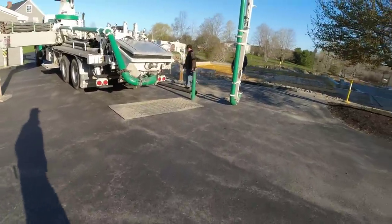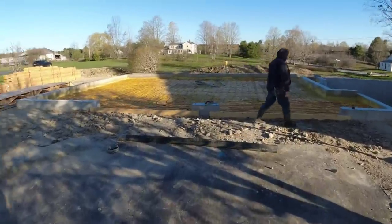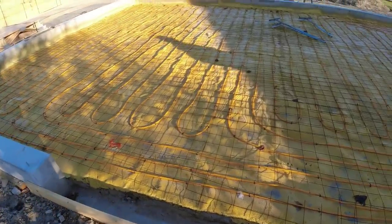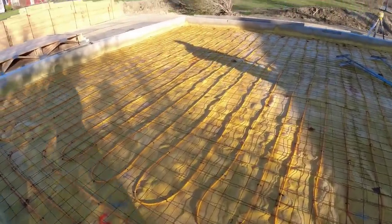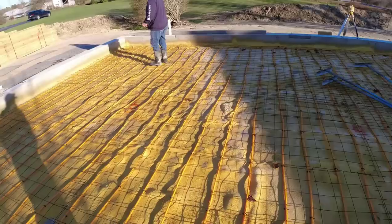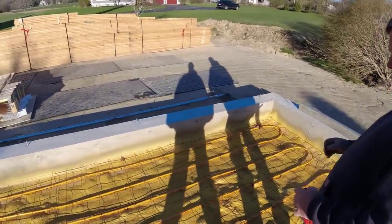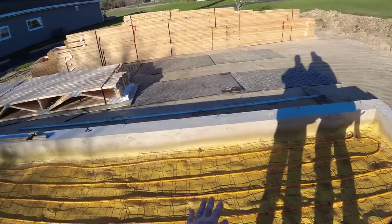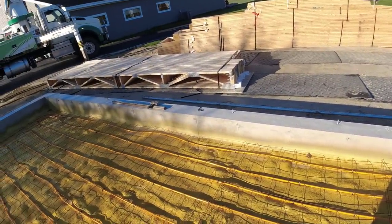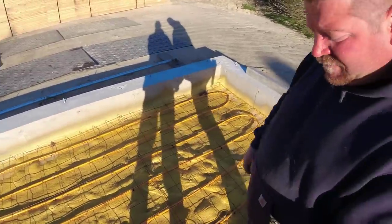You can see what that spray foam looks like on top of the dirt — pretty uneven. It's all up and down, pretty wavy. A little tough to figure concrete on this stuff. Luke, it ain't much of a difference here — I'll just mag it up and then it'll just kind of taper. I just want to check that blue mark there. It went from there to there, yeah. We can snap another line real quick from there to there and see how much difference there is.